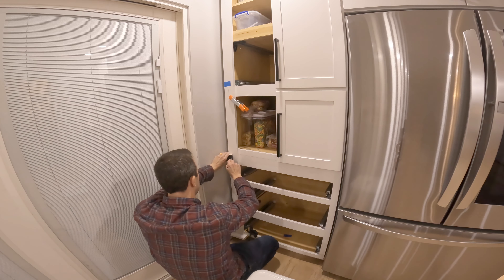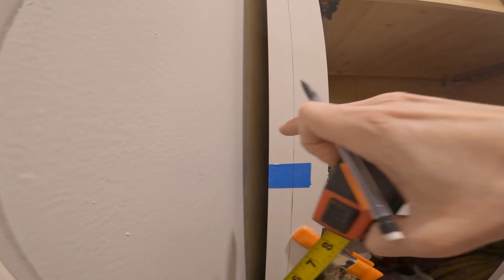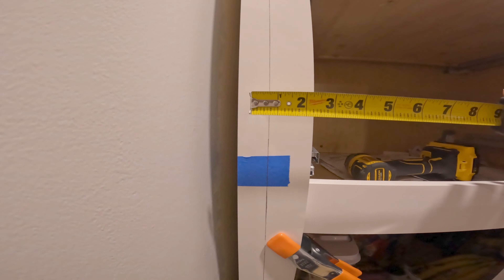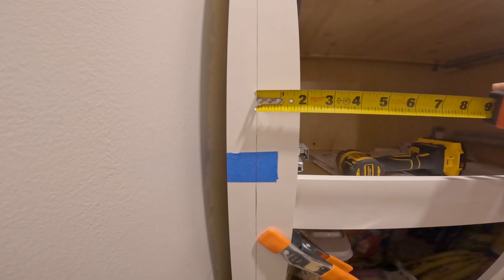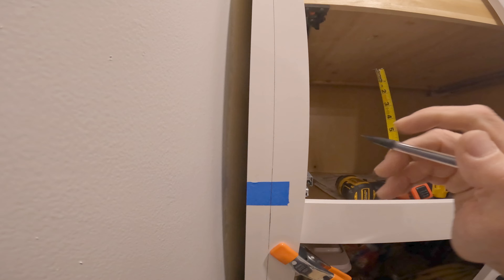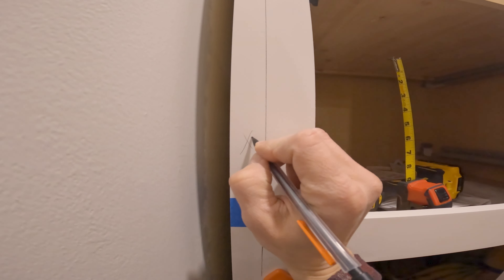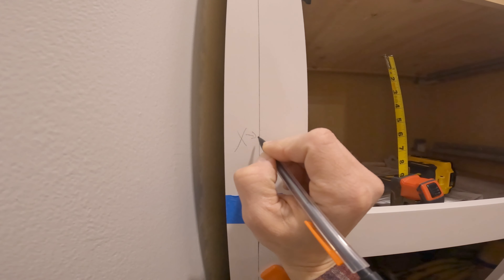What you do is take this piece of wood, set it on there, and line this edge up with this edge here — this is where the tape comes into play. We're going to tape this so that it's flush or flat with this side. Now what you can see is this piece — the scribe — is perfectly flush with the side of the cabinet and it's being held in place with the tape.